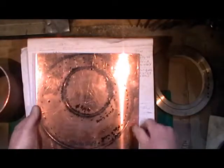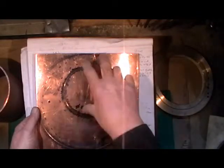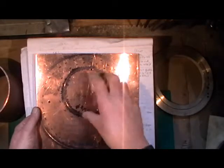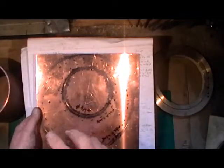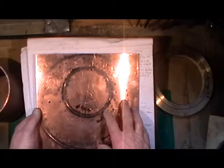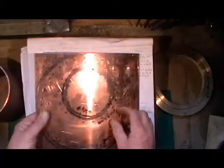I've now managed to get my pieces of copper marked out and I've put the different offsets on each piece. For example, this is the back head - the throat plate will have a different offset, not as much as the back head. I've got them ready for cutting now, and I'll cut them on my scroll saw in my woodworking shed.